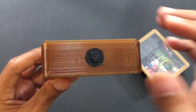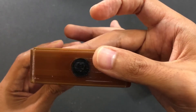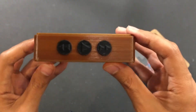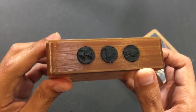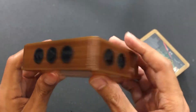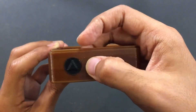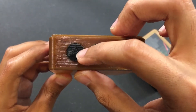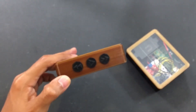There are a little bit of ringing artifacts, and you can see a small gap here — a margin of error. You can calibrate the machine, but it only calibrates flat on X and Y, not on Z. These are printed upward, so only some of the buttons are off. The three printed facing forward are pretty good, but the ones on the side have that little gap. It's offset a little — not perfect, but it's pretty darn good. I haven't seen any other printer that could print it this well.